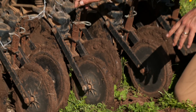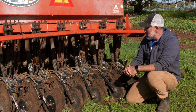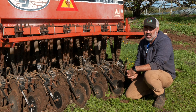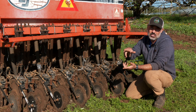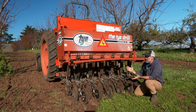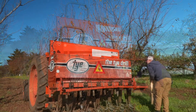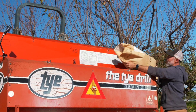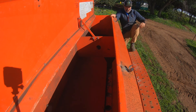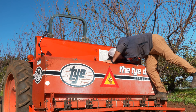We set depth using spring tension adjustments on the tamp wheel and set springs that adjust the downward tension. But most of the cover crop seed we sow, especially wintertime seed, is just so hardy — you could put it two inches down or five inches down and it would come up. That's what we've found. It's one of the most simple implements on a farm and pretty ubiquitous across the country — one of the most important tools on the organic farm. So here's our seed, a 50-pound bag of purple vetch. I'm going to put in about half of it, somewhere around 25 pounds, and once it's in the hopper I'll spread it out so it gets evenly distributed and none of my drops are empty when I'm driving.